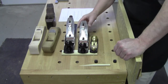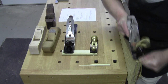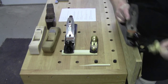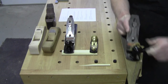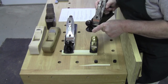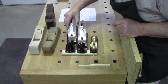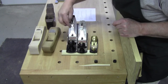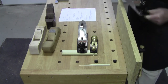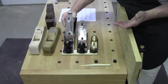So it's more a matter of what do you want to make and then fitting the tools to that. Some people say you can do everything with a number four, and that's fine. But for me, I find the number four — because of the distance between the toe and the cutter being so much less — I find the number five registers better for me. I have big hands, I like the number five.